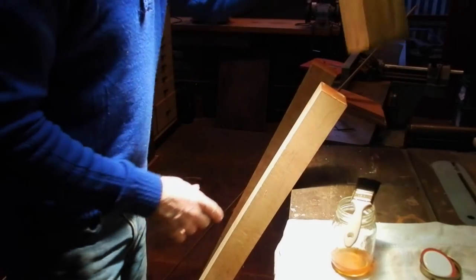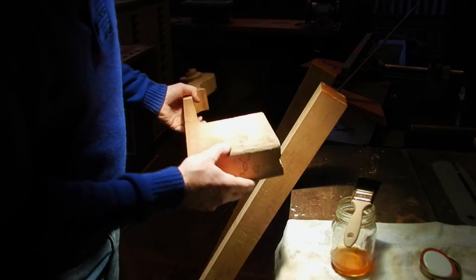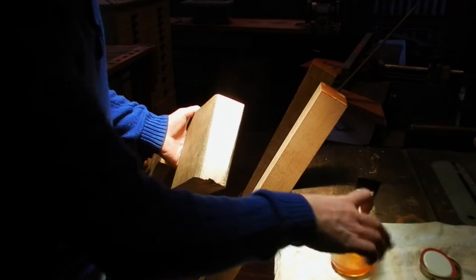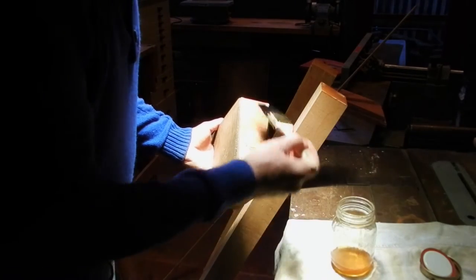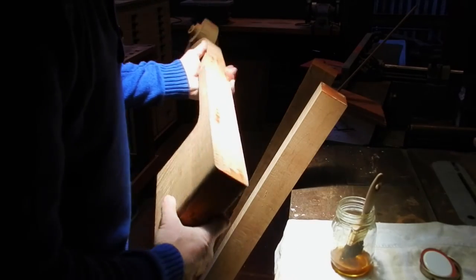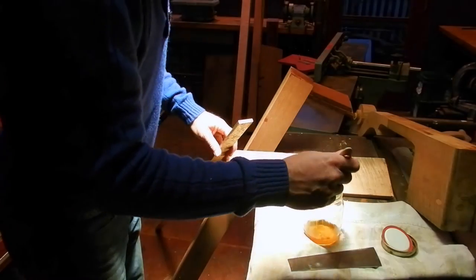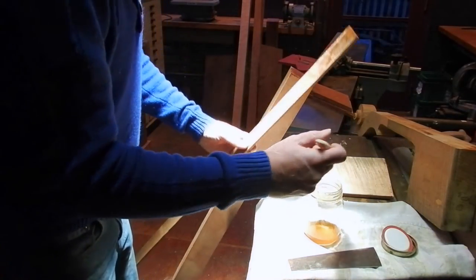Here's another example — this is a piece of furniture that was salvaged for a carving exercise. You can see the grain is quartered, but it's in the opposite direction that you want. You want the grain in this direction to get your strength. One piece in the family of quartersawn that's most famous is oak.